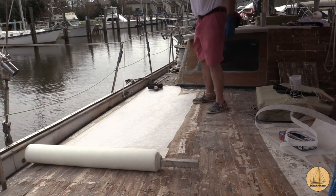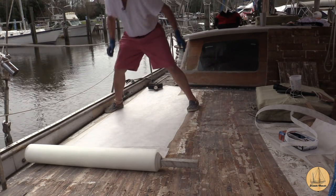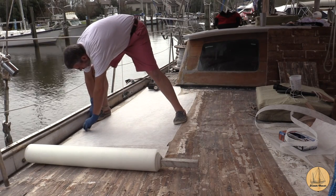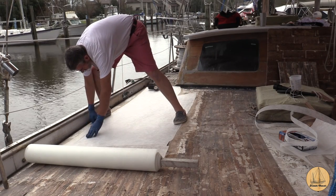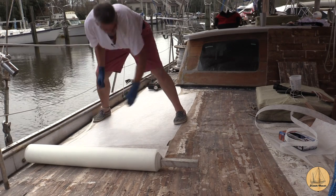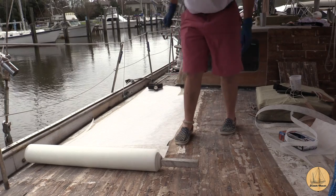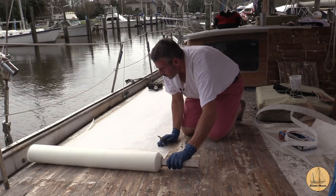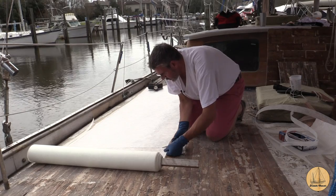It's starting to go up on that section of the deck - you can see where I'm walking. That section of the deck is ground all the way down to the fiberglass. What I'm ultimately doing by building up those layers with each piece of fiberglass being wider than the previous one is starting to integrate it directly into the existing deck so it will be just as strong as when it was one giant sheet.